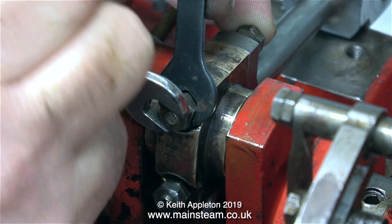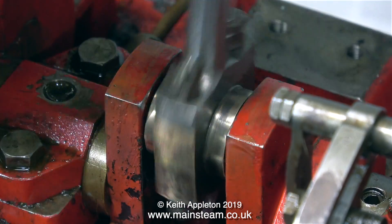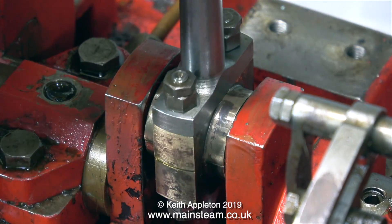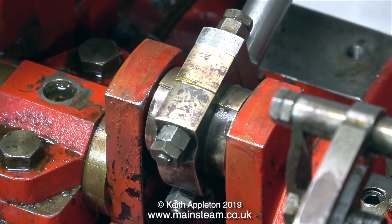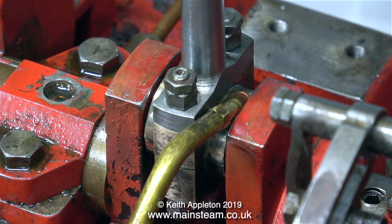As it turns out though, they're feeling okay. I've fitted the lock nuts, and here we are. I'm going to start the running-in process even before I reassemble the rest of the engine, just by moving the big end bearing back and forth on the crank pin. And I think I can engage smug mode with this, because it really is a very good bearing fit.